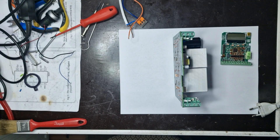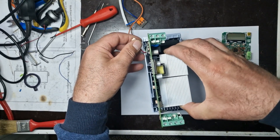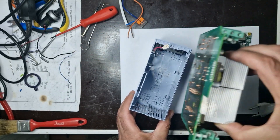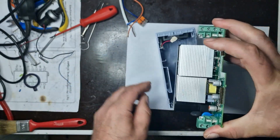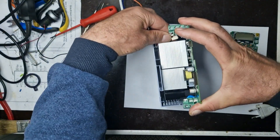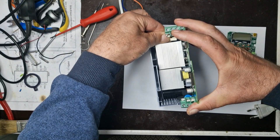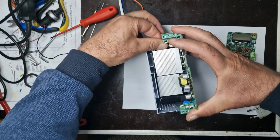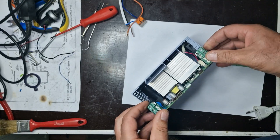Let's recap. I started by doing a visual inspection of the board, looking for bulging capacitors, burnt resistors, or any signs of smoke, but didn't find any major issues at first glance. Next, I moved on to multimeter checks, measuring the voltages on the control side — 12 and 24 volts — but no voltage was detected, indicating a problem with the power supply. As a precaution, I used an incandescent bulb to limit the current during testing. I also checked the capacitors, measuring both their capacitance and ESR with the ESR60 device, to ensure there were no faulty capacitors that could affect circuit stability.